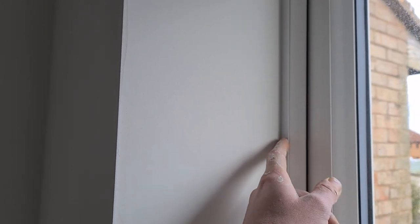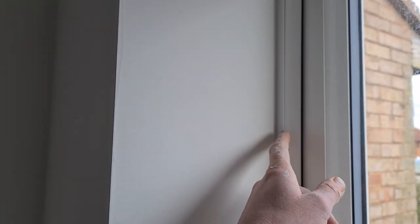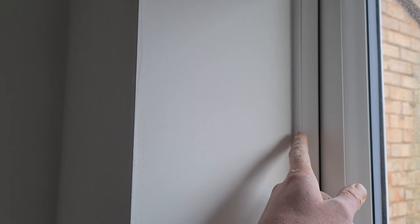We're using the snap-off beads, or the tear-away beads. Take a little bit of time to install. But once it's snapped off, we're left with the plastic edge there. And obviously against the plastic window, plastic against plastic with a little gap gives any frame sealant a piece of plastic to grab both sides so it won't peel off like it does if you use cork. Once installed as well, we find it makes it really quick and easy to sand and really quick and easy to apply.